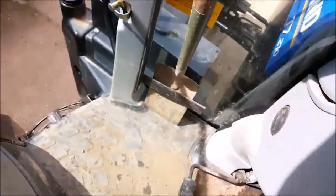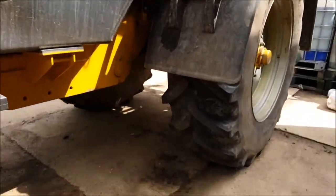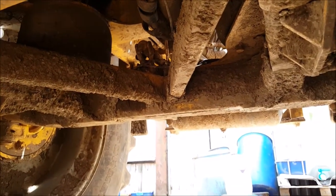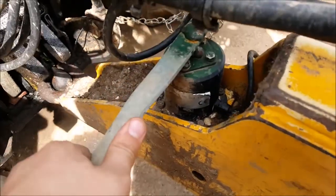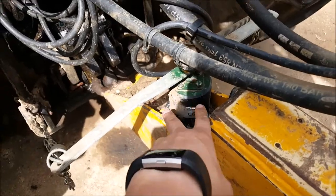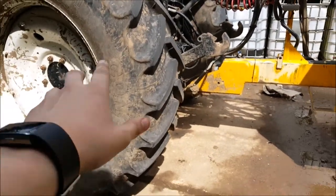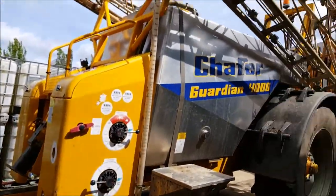Down there we've got a way of controlling the rear axle because this rear axle is steerable. It's got a little locking mechanism up underneath which has a tendency to break — that's a manufacturing defect. It works off a potentiometer-type thing, and as you're going along and you steer, it recognises your steering, so in the field these rear wheels should match the front wheels in their steering pattern. That way you shouldn't run over any additional crop, because it's a trailed machine which makes that more likely to happen.